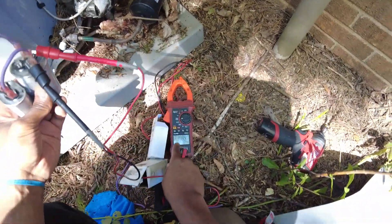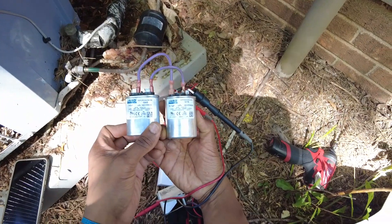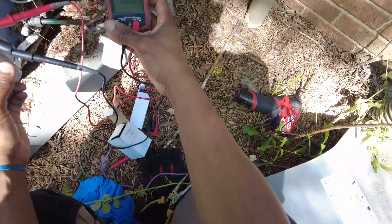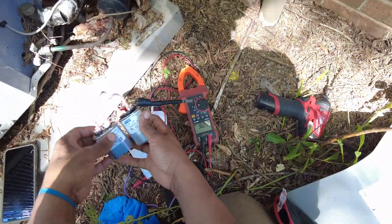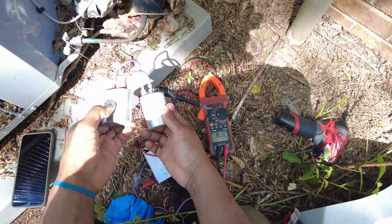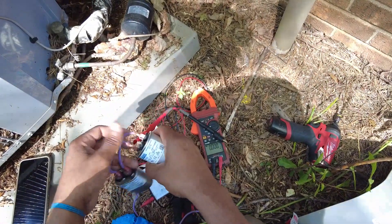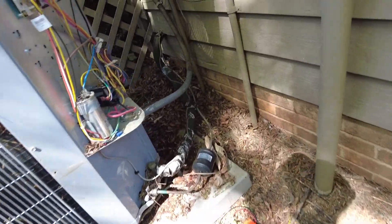And now, 36.9 — that's a 35 micro-farad capacitor now, that's just how I've got a jump there. And once again, 36.9. And all we're doing is essentially just — the Hermetic side and this 10 micro-farad is just running in parallel, so it's just giving us that much more capacity. I like to just tape them together.